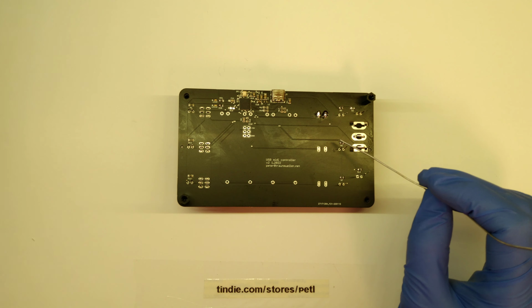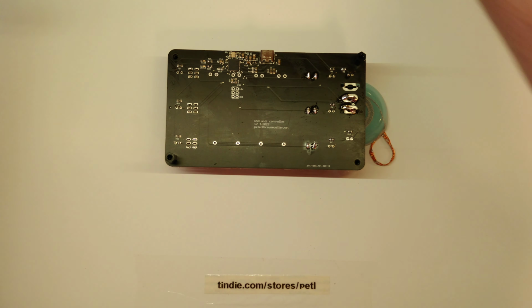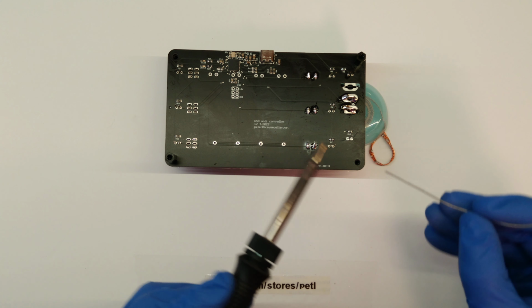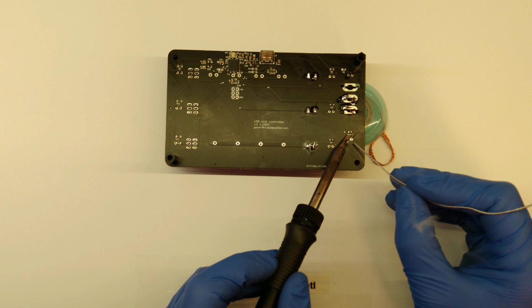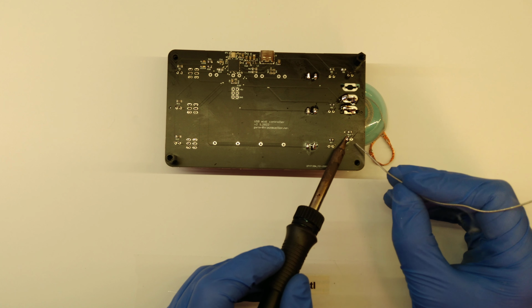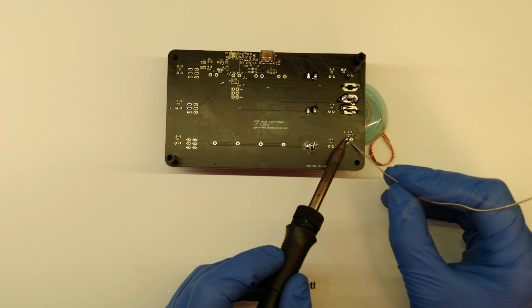them on, while I'm getting the lead-free solder in on again. And it looks like the solder has already started to be weird, so let's clean the tip again. That looks way better, and use a bit of fresh solder so that we have more flux inside, which can actually run onto the solder pad. That still looks really bad, so a bit more cleaning and then a bit more temperature adjustment probably.